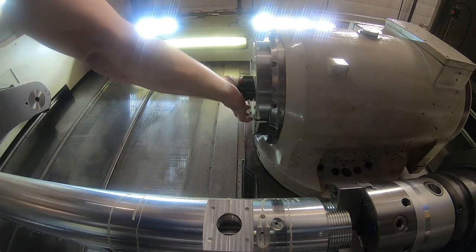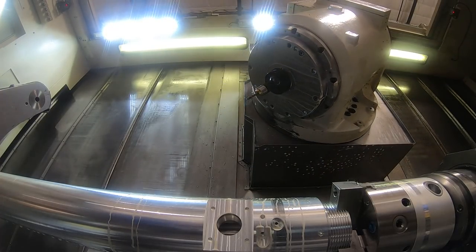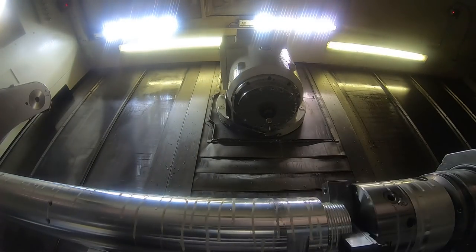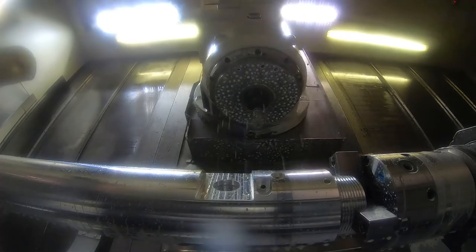See, this is the larger drill that I'm talking about that I have to drill, which is the tap drill actually for the 5/16-24 thread I'm going to mill later. And you'll see here it drills in there, but the gun drill intersects that hole, and I want to drill this hole first. And then you're going to see me come back with the gun drill. Those two holes are just to rough out what gets done later.